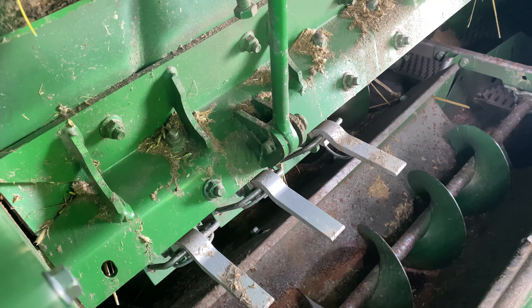What these dividers are for is to allow you to slide up the dividers so you can keep more of your grain in the center of the combine, to help prevent high seed loss or material buildup on one side of the combine when you're harvesting. Typically you would see this more if you were on hilly terrain or side hills, but there are instances where you would have a lot of buildup on the outsides of the machine rather than the center.